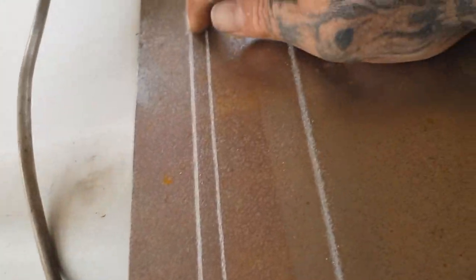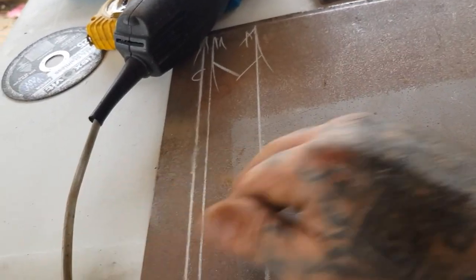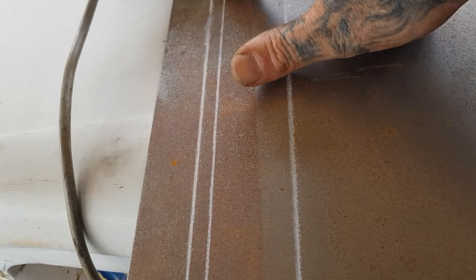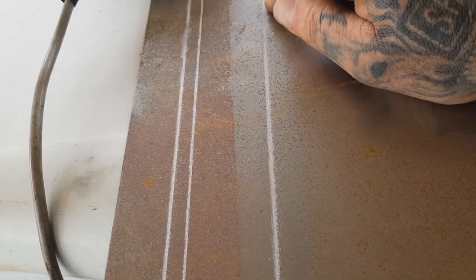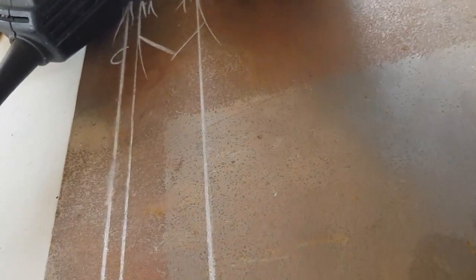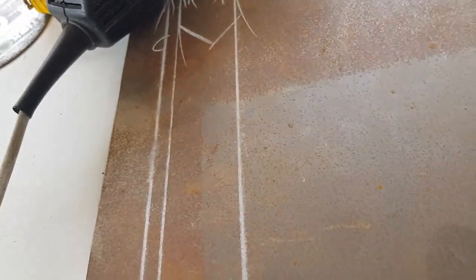Flare that out for our bottom to match our door, and we'll make another panel up. And then this is basically where our fold will be. We'll probably do that on the car. And this is basically the low edge of our bead. These little marks here, they would be the top edge. So we basically, we're on a roll from there to there, kind of.